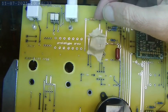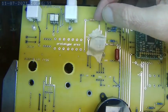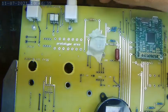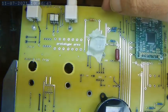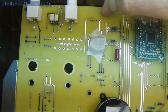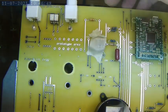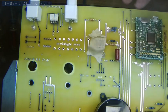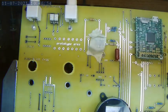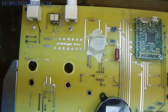So the purpose of this resistor is that we want to actually adjust the current that's flowing through this to the hydrogen generators. And so the way we do that is to actually measure the voltage drop across this resistor, which will be proportional to the current through the resistor, which then is the current that's going to the hydrogen generator. And that'll be the next step, to measure that voltage drop.